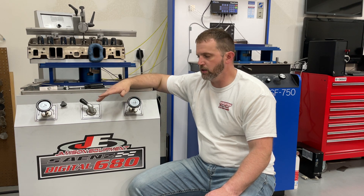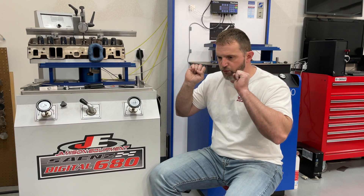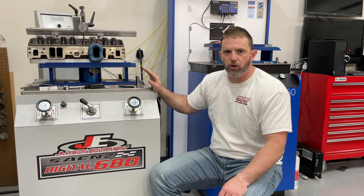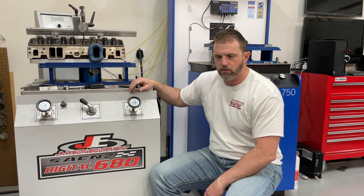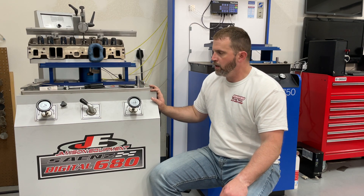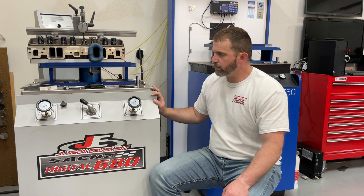I called Jameson and told them it kept burning up motors. He said the issue was I had an older model — all the newer models have this motor controller. What that means is before, when I turned it on, all nine motors were working at full blast 100%. So you had to use the dampener at the back to take it easier on the motors, but they're always wide open — no need for it. You'd be flowing a head that flows 230 CFM and all nine are giving it hell. The new ones have an electrical device that gradually spools the motors up to match the demand, always getting right to 20 inches. He said send in your bench and we'll put it on yours and just charge you for the part.